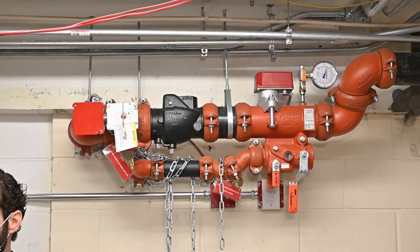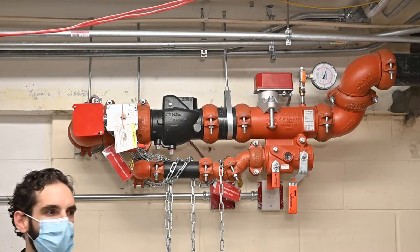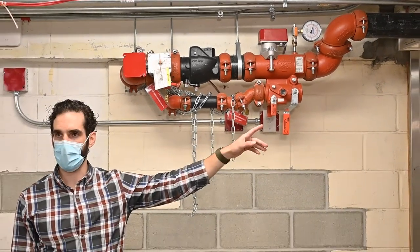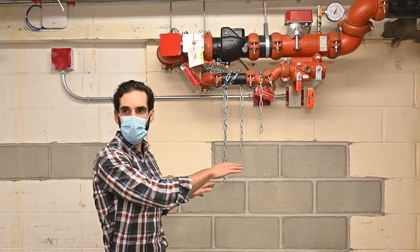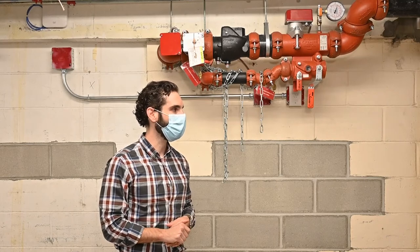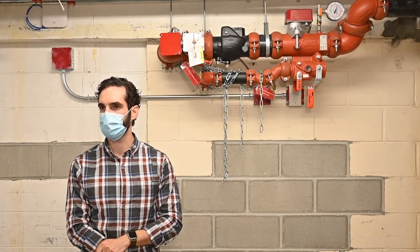Training today, we're going over all of the fire suppression systems on the fourth and fifth floor for the rare books improvement. That would be the wet system, which is just the lobby area, and then we have the pre-action system, which is the dry pipe — that does all the rest of the spaces and is always dry unless there's a smoke alarm and a sprinkler that breaks. You have to have two things happen for that to go off. And then we'll also be going over the clean agent system, which is the Novec 1230 — a liquid that gets expelled as a gas.